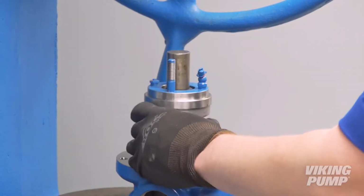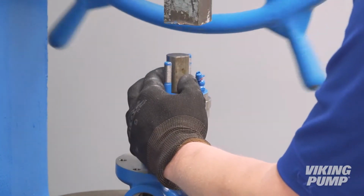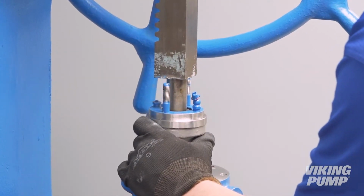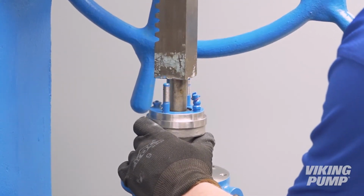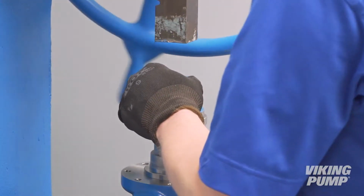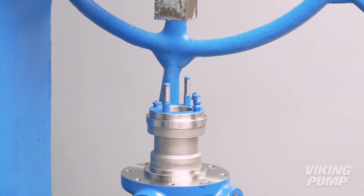When installing, use care to avoid breaking or damaging the carbon graphite bushing. Bushings with lubrication grooves should be installed with the groove at the top or 12 o'clock position. Use a lubricant and make certain that the bushing is started straight. Use a press to completely install the bushing in one continuous motion. Starting and stopping will crack the bushing.